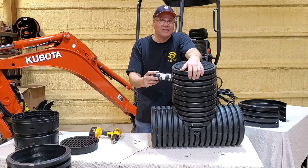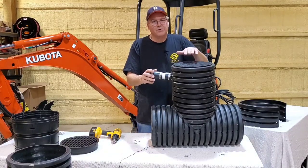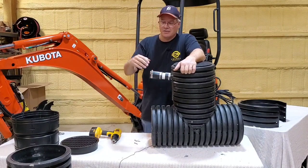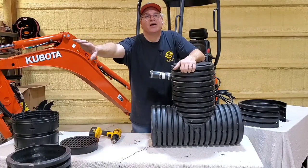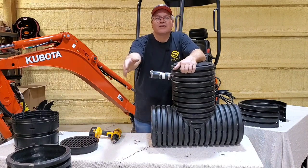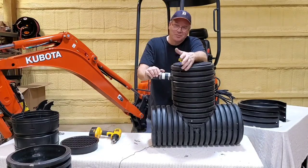And one of the ways of doing that is in the design. You want to make sure that however you lay this out, say your yard's pretty flat. Usually these systems are going where yards are flat. Well, then don't put it in the far back corner of your yard and pump it all the way out to the front yard. Instead, go ahead and put in your quad pack, run it to your sump, put that sump on the side of the house, not against the foundation. I don't do that. You never see me do that. But just, you know, put it more on the side of the house. Get it to where that discharge line is not as long. Sometimes you end up a little deeper when you do this, so you might have to go to a 3-foot unit that we literally just put in the store, a 3-foot unit.